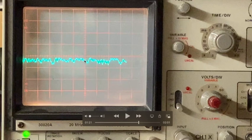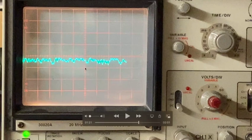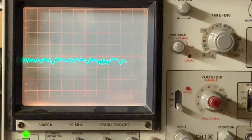The second thing that's happened is, as the signal gets stronger, as you tune in more closely to the center of the frequency, this voltage drops. The DC portion of this voltage drops. And keep in mind that AC and DC can coexist and do quite happily on a wire. It doesn't have to be just AC or just DC. It can be both. In this case, it's both. It has an audio signal, and it also has our AVC or AGC voltage. AGC, AVC control the amplification of the previous stages.